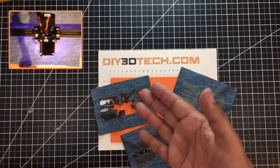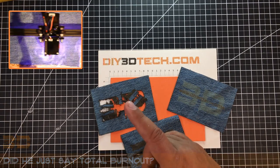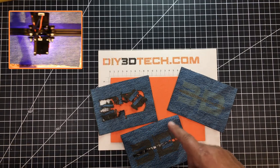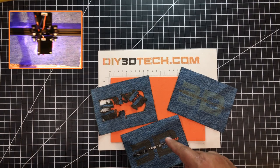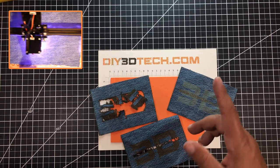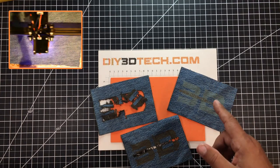With this sample, as you can see, it's a total burnout — it was 8 millimeters a second with one pass, dithered at 150 DPI. This one down here was at 20 millimeters a second, two passes, 150 dithered. This one is 50 millimeters a second with one pass.